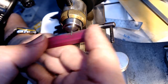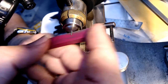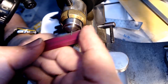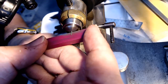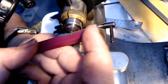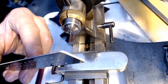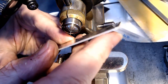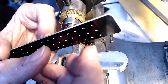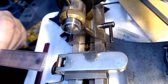It doesn't take a lot off all at once, but you don't want any pressure on that because you're making the world's smallest shaft. Just like so. And you can add a little oil to it to keep it nicely lubricated so it doesn't heat up too much. That's how you do it. There, now I've tapered the end so I know that the end of the gauge fits 28. So there we go, fits perfectly on 28, which means the rest of the shaft has got to be the exact same size as the end of the gauge. So I got to keep working it with it.